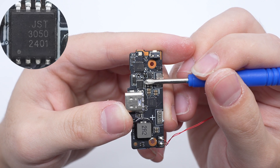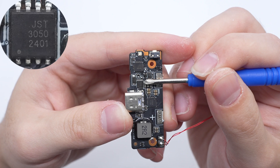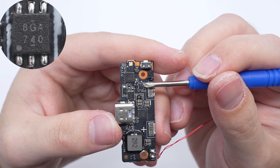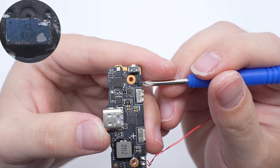The V-bus MOSFET for the USB-C port is from Jestek. It has a withstand voltage of 30 volts and adopts a PDFN 3.3x3.3 package. The battery protection chip is marked with 8GA. The battery protection MOSFET is marked with 6A4998.